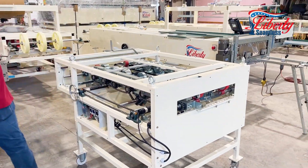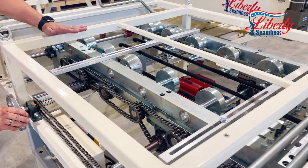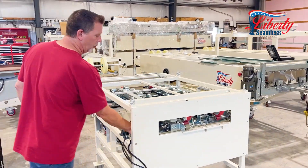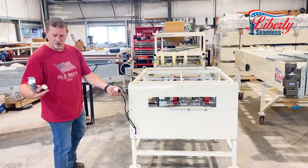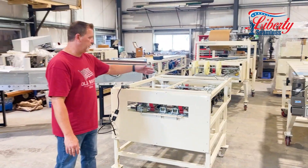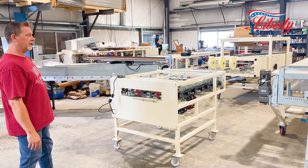This machine is adjustable. You crank this out and it will do up to a 28-inch wide coil. It runs off the same features as the pro models with the limit switch for your length control — when this one's just plugged into the machine, you run an extension cord in between for your length. This machine also has the same capabilities for bead or pencil ribs, and has the clip relief rollers as most needed with the one-inch or inch-and-a-half mechanical pull front.